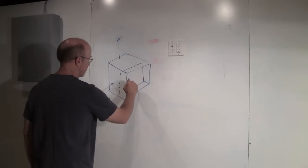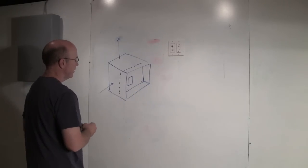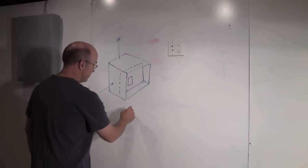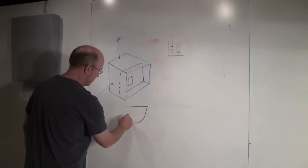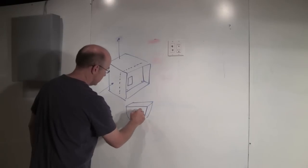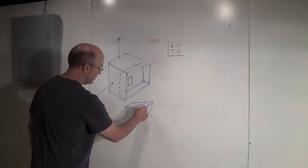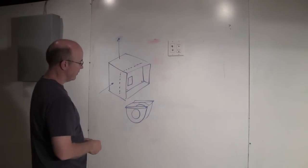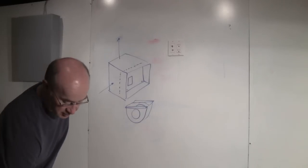So in here, I had a circuit board, control board, a bunch of wires mounted. On mine there are a couple screws here, which you'll see I just pulled out. And then the blower assembly basically comes out in one big piece. So basically it's a big thing like this. It's got an opening for a squirrel cage motor. Try to do a little 3D here. Kind of looks like this. There's a little piece on the top. But anyway, there's some rails on here, so to speak. And this whole thing just slides out. You take two screws out, unhook the wires and pull out. It's very easy, and then the fan you'll see later mounts right on this housing. So it's very easy to change in this particular model.